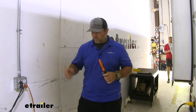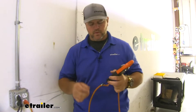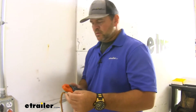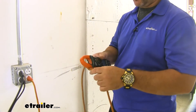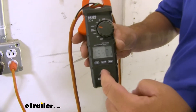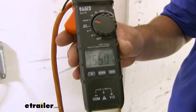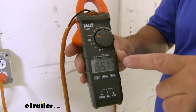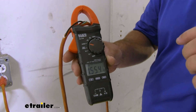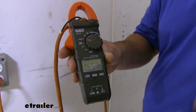We have a meter here. What we did is we took an extension cord and pulled out the power wire to it. We have it hooked to our main wire going into our camper. We're going to test it coming straight out of the wall, and what we're looking for is a reading of what we're pulling out of the wall directly. Without our AC running, we're at around 1.5. Now we're going to turn the air conditioner on and off about three times — it's going to go quick, but we're going to see it spike up. We want to find the highest reading, which will tell us how much our air conditioner is using or pulling to start.